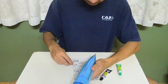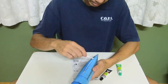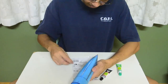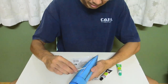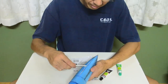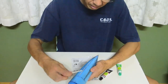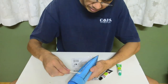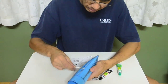I'm going to mix the epoxy here, and what you see me doing is just filling in that slat right there. Let's get that epoxy in there. You've got to work pretty fast with the five-minute stuff. Let's get it all filled in there. I'm trying to make sure there's no air pockets in there — let's fill it in good. Brush it in there.